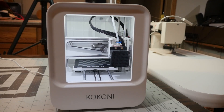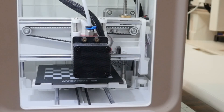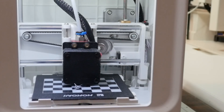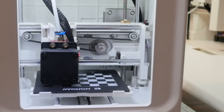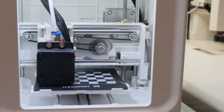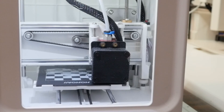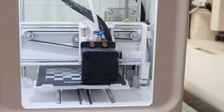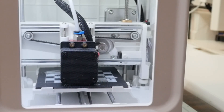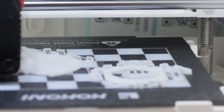It's now homing - it is preheated. You can watch the status of everything it's doing on your phone or tablet. What it's doing now is laying down a purge line. If you're not familiar at all with 3D printers, what it's doing right now is laying down its base layer - the first layers - and everything is built on top of that. The phone app is telling me it's 20% complete and it's starting on its infill and working its way on up.